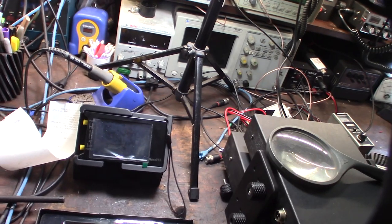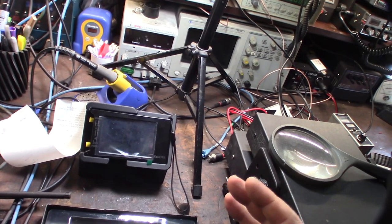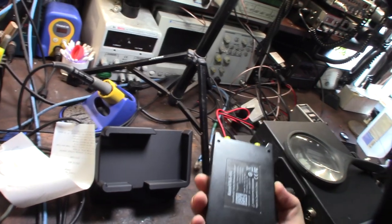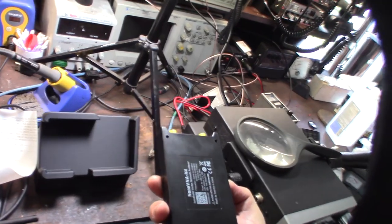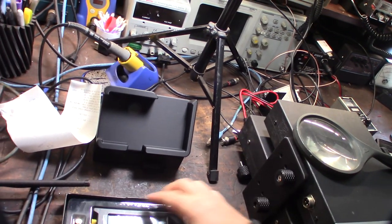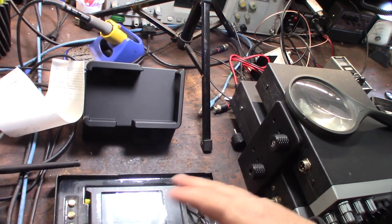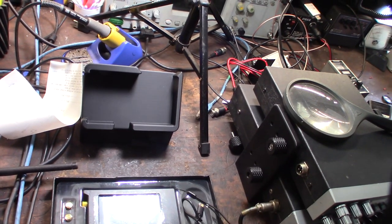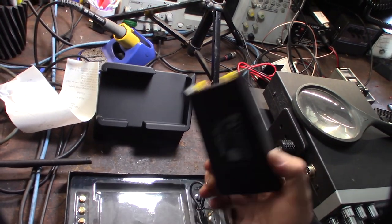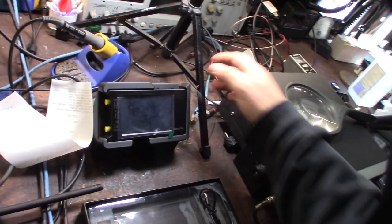My guess is there might be two 32-bit ARM processors down here, because typically, even in the 3D printing world, you'd have an ARM processor that controls the logic and function of the board, the inputs and outputs, and then another ARM processor which controls the LCD. So the LCD might have its own ARM processor, which controls the actual function of the touchscreen. Just because the ARM processors themselves don't have a lot of storage capacity. But let me open it up. I'll go into more detail.